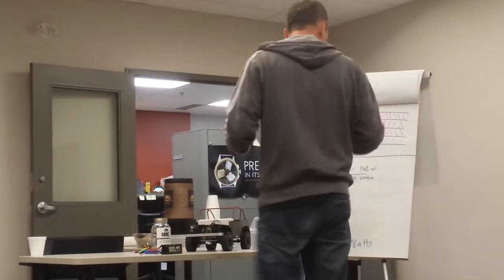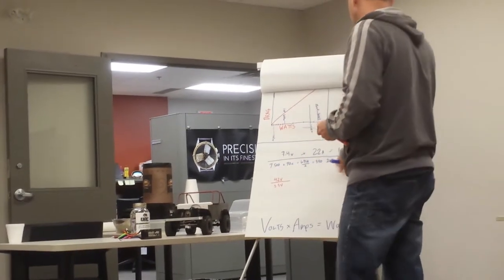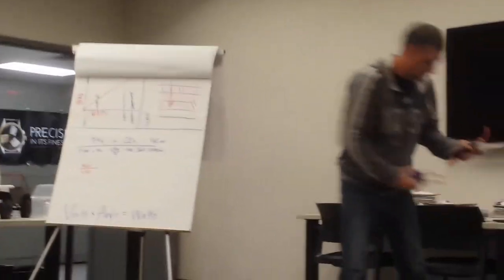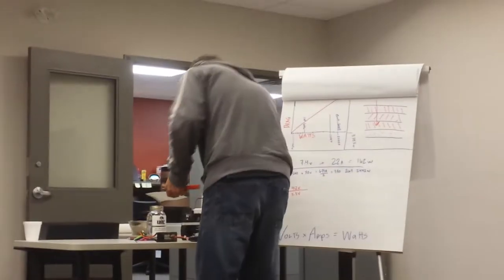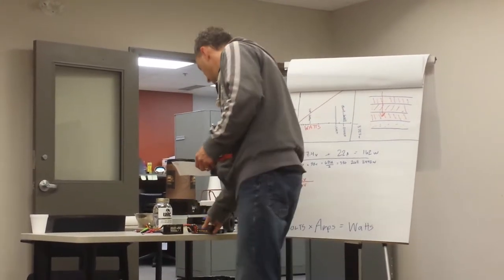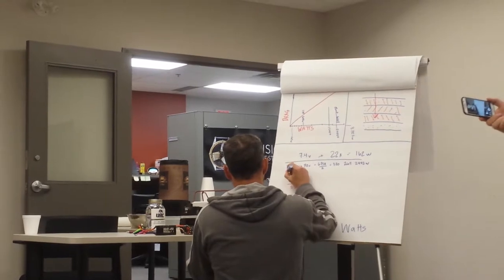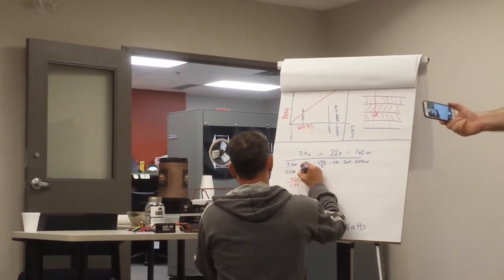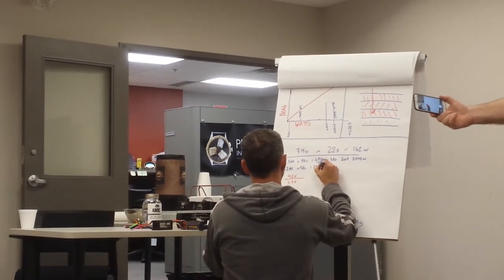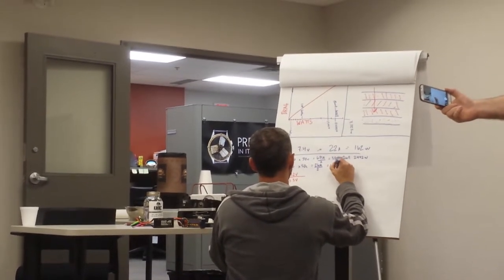Okay, so I want to show you some interesting math here. This will be the last thing I've got. Let's just say we have this 7590C and it can put out 2400 watts. And we're going to move to this battery right here. This one is a 5200 3-cell. This is a nice big battery, by the way. There's a little plug for Helios RC. Anyway, great batteries. Let me write down the numbers on that because this is a really interesting thing to see. So this is a 5200, and it's a 50C nominal. That turns out to 260 amps. We're going to divide that by 2 just because we want to be safe LiPo users. That gives us 130 amps.